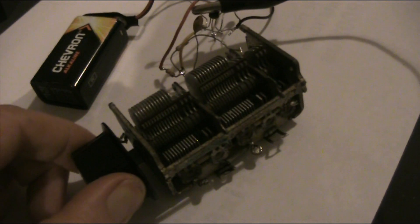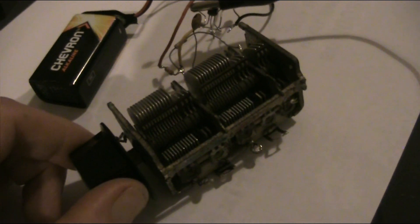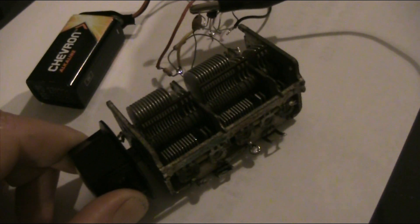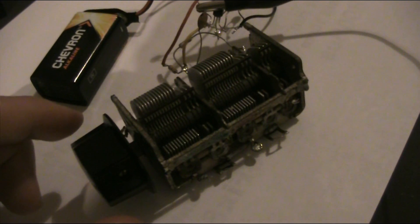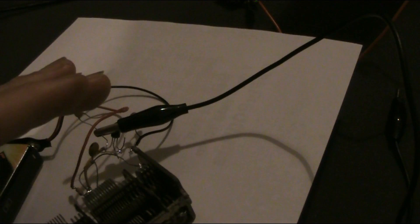If the band is busy you might be able to tune in to several stations. It's a good idea to be able to vary the coupling — here I've got a loose wire coming from the BFO. It's not actually electrically connected but it's radiating enough. If signals are strong, put the wire near the wire going to the antenna.